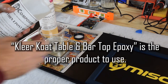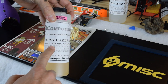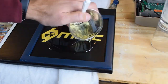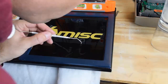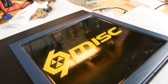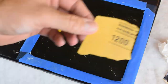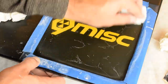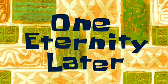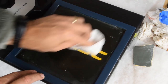This is not the right product to use — the right product would be a clear coat bar and tabletop epoxy. What I had was just some epoxy I had lying around because I'm into rocketry and I use it for fiberglassing. I figured I could do this nice and thin and have kind of a clear coat. But the surface crazed on me so it wasn't a nice smooth finish. So that kind of sucked — now it's time for me to start wet sanding. I sanded with 1200 grit and 2000 grit. Then I tried to polish it up and it showed there's a whole bunch of grooves in there. A lot more wet sanding from 320 grit up to 400 grit, and then an eternity later I'm trying to polish it and just not really getting it to be glossy smooth. So basically I said, alright, that's enough — spent way too much time on it. I used some Pledge to get as smooth a coat as I could.